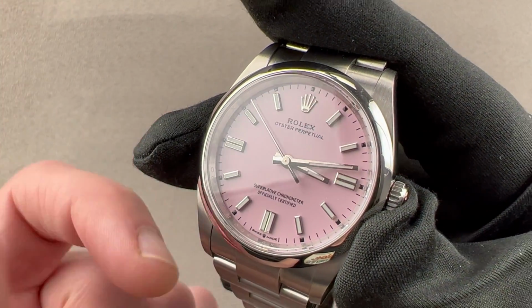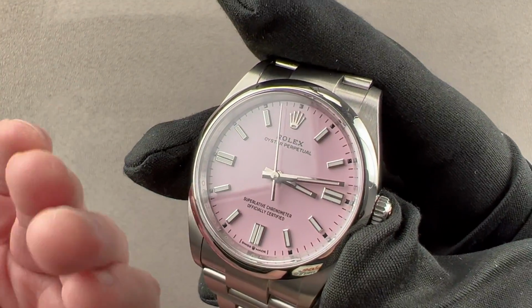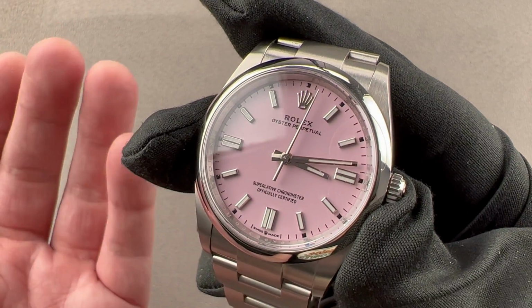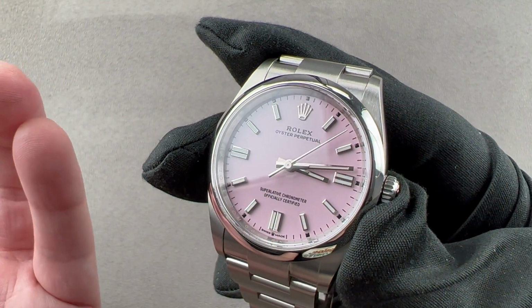It is chronometer certified, but Rolex goes one better and takes the certified movement, cases it up, tests it in 6 positions, and attests that the fully assembled watch will run no worse than -2 +2 seconds per 24 hours from the factory, hence this term superlative chronometer. Once just advertising spiel, today it actually has an objective basis.